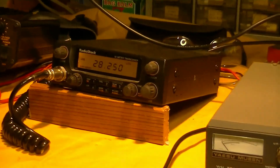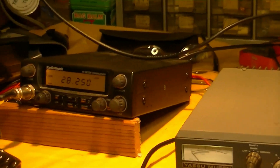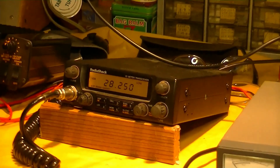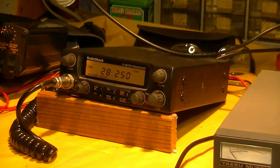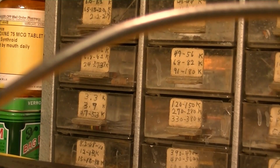I think any deficiencies here may have to do with the HTX-10. You have to use the fine tuning — the RIT — to tune it in, and it doesn't seem to be the best thing in the world. Not sure how stable it actually is. But this seems to be about the best we can do.